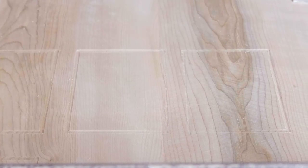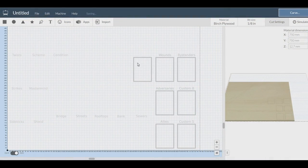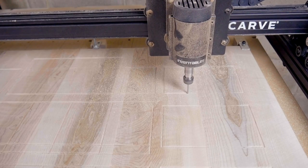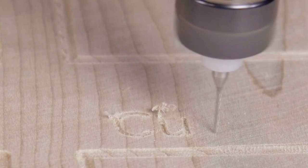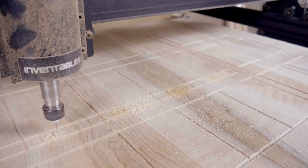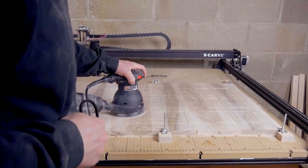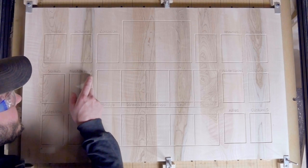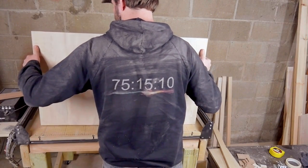To fix this, I waited until the X-Carve had finished cutting all of the card outlines, and then I went back into Easel and had the machine cut the borders on the right-hand side again, this time a little deeper than before. Fortunately, that worked very well. When I moved on to cutting the text with the smaller bit, I also told Easel to cut a little deeper on the right side than on the rest of the board. I was certainly nervous something would go wrong with my last-minute adjustments, but it came out looking quite nice. The cutting bits left just a small burr around the lettering especially, but this is easily removed with some fine sandpaper. The board really could be used as is, but I had my heart set on making it slightly elevated, and I also still need to deal with it being warped as I mentioned earlier.